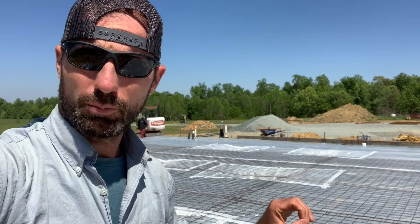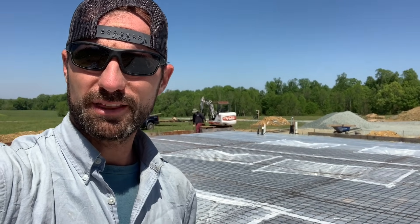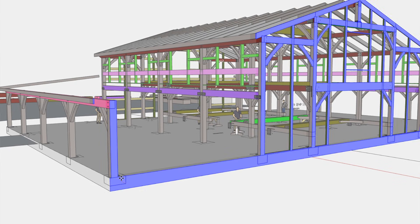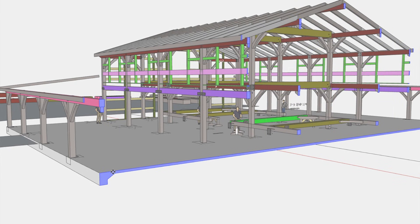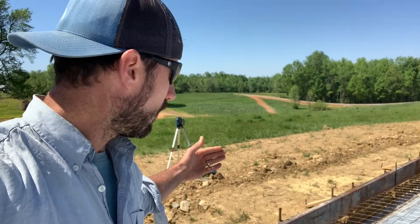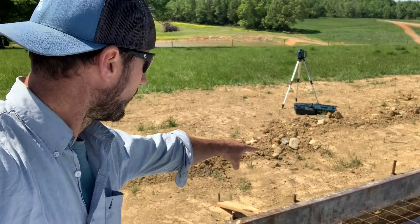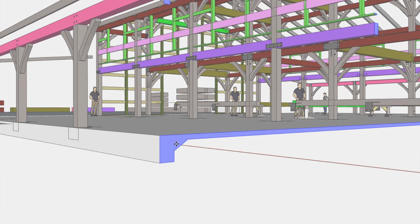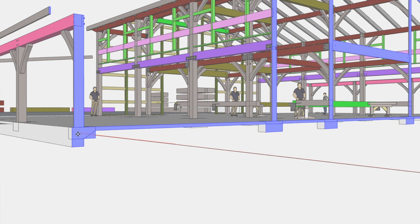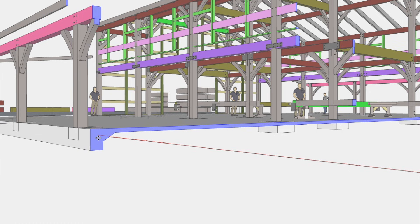We're prepping for pouring a concrete monolithic slab foundation. What that means is monolithic slab — mono meaning one, lithic meaning stone slab foundation. That means it's one concrete pour that's going to be the footings, the rest, and bear the weight of the framing above. The footing spreads the load of the frame that sits on top of it. The foundation wall, which is the vertical section right here, and the floor — all three of those elements of this foundation, the footing, the foundation wall, and the slab floor are all done in one concrete placement. So that's what makes it a monolithic slab.